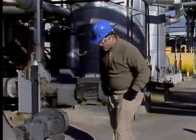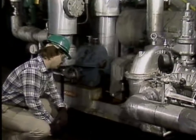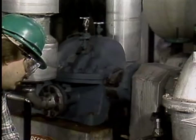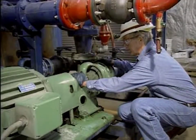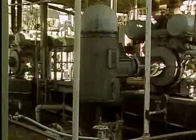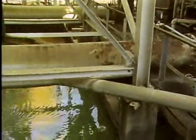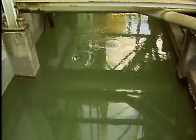There are several ways to tell if a pump is air-bound. One way is to listen to it — a pump that's partially filled with air may produce a rattling noise, similar to the noise a pump makes when it's cavitating. However, the noise caused by air-binding may be heard only intermittently. There are other noises that may be associated with air being drawn into a pump — for example, if the pump has leaks on the suction side, you may be able to hear air being drawn in. In some cases, it may be possible to see the flow path for the air. With sump pumps, a vortex may form as liquid is pumped from the sump, and if the vortex is drawn into the pump suction, it provides a path into the pump.